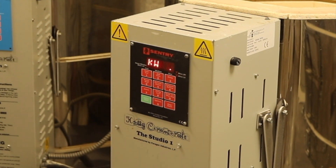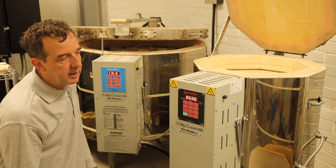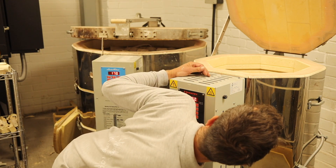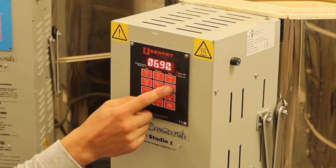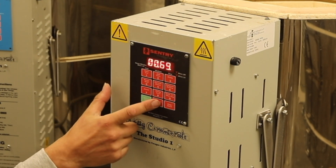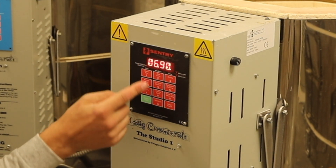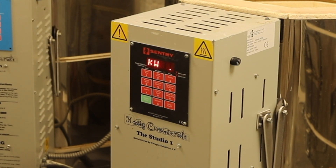If you press Options one more time, we get 'kw' for kilowatts. This is a P01 kiln and it is running on 6.9 kilowatts — if you look on the side of the kiln, the plate will tell you watts: 6900. There's a decimal point, so enter six, nine and position the decimal point correctly with a zero so we've got 6.9 — because it's asking for kilowatts, that's 6.9 kilowatts. Press Enter and that's now in the kiln's brain.